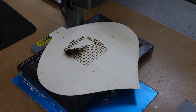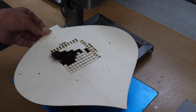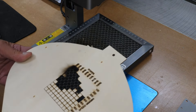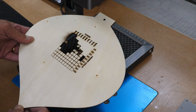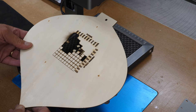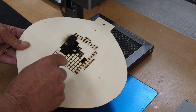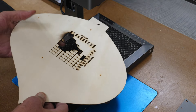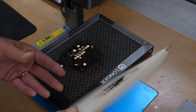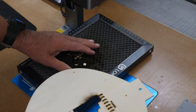I stopped this for obvious reasons — getting a little too hot up there. Knocking some results off to check the back. At 30% power and 700 millimeters per minute I could get through it. By the time it's working up through the higher-speed rows on the grid I'd have the whole thing on fire. Getting close on some of the other test cells too.